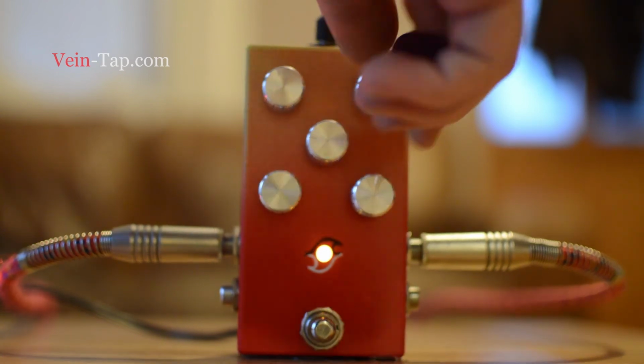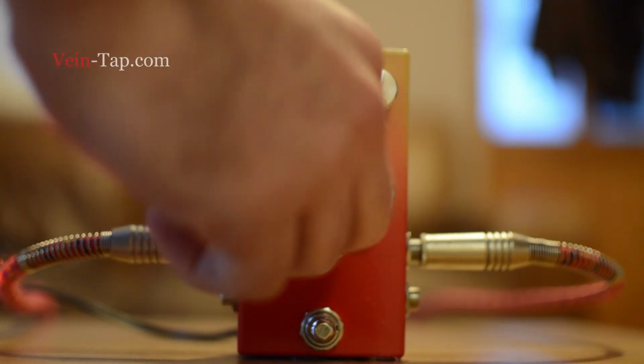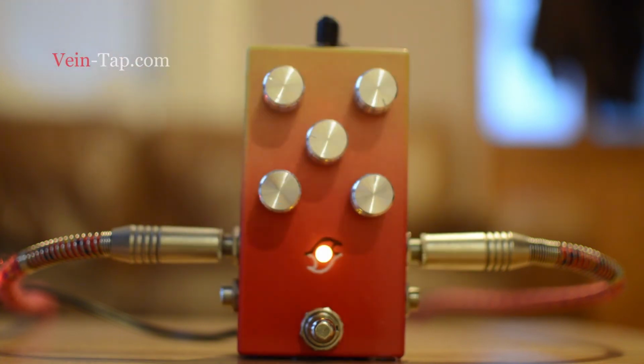The lower right is the center shift control. This might be quite new. What that does is it takes the center part of the wave and moves it to the left or the right. So you can have more signal relative to silence, or more silence relative to signal. In the center position, you'll get equal signal and silence, like this.